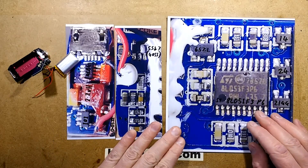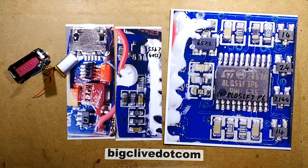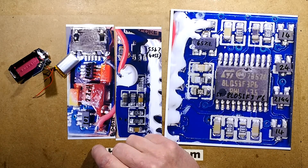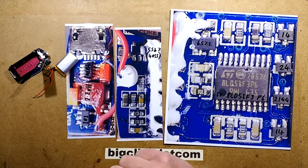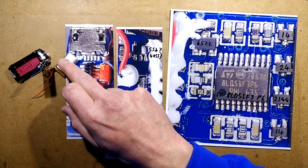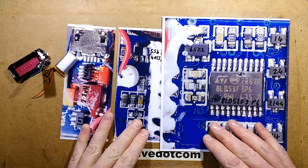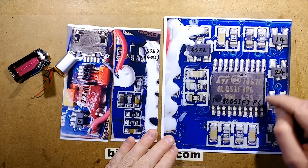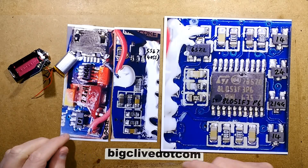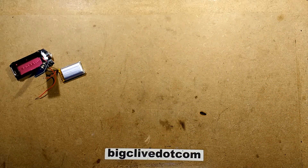Let's guess what the cheap copy will have: the classic 8-pin chip, everything on a single circuit board, a resistor in series with the LED or a different LED, driven via a transistor from that little chip, plus the charge control chip — because that's what the copy of their other flashlight had. I'll buy one if I see a cheap copy come out. But this is genuinely complex — really complex — like a full-blown computerized control system, which seems overtly complicated for a light that only has four intensities, yet they're clearly aiming for constant-current regulation.